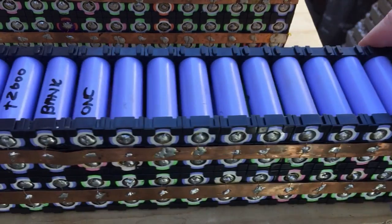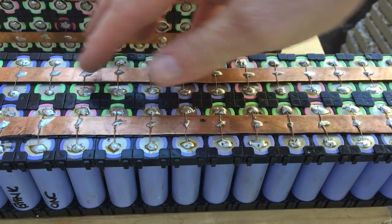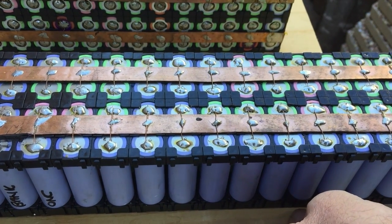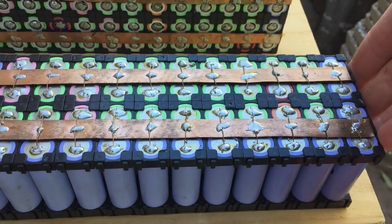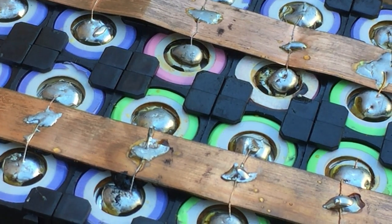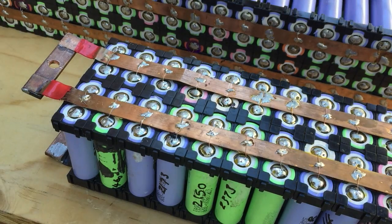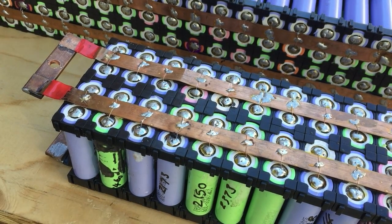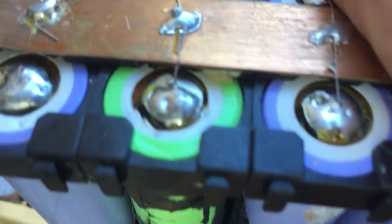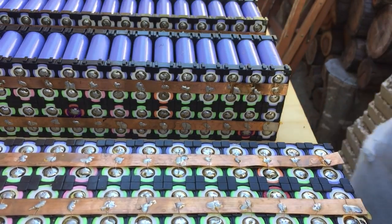This is pack number one. The negative side is all nice and clean — no broken solder points that I can see, that all looks really good. After doing a physical inspection I did a continuity test, but unfortunately the continuity test doesn't take the negatives into account, so that doesn't work — I learned something there. We've got two broken cells: pretty much number one cell and one further down.